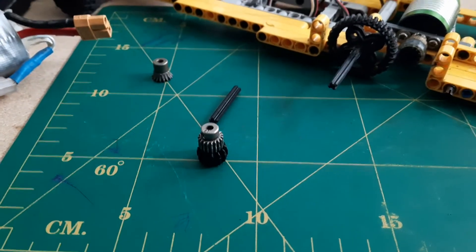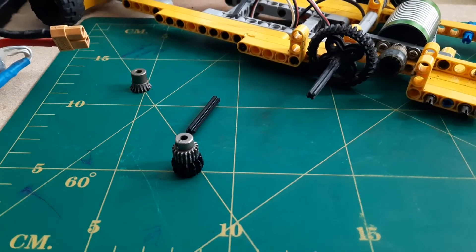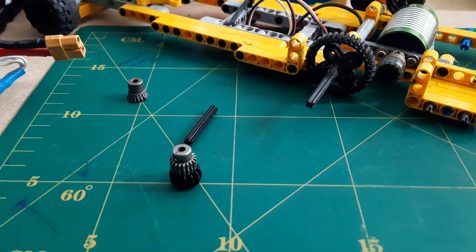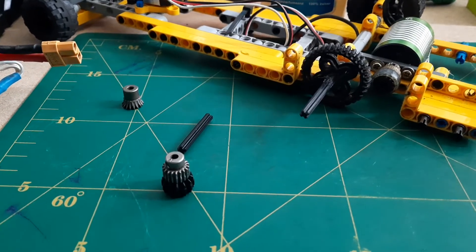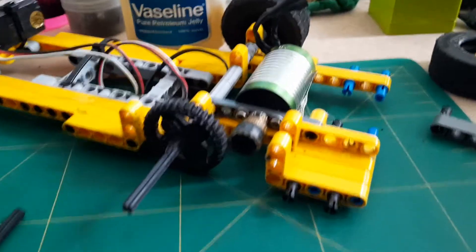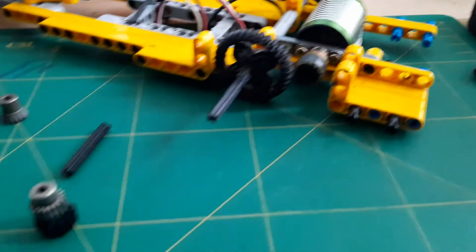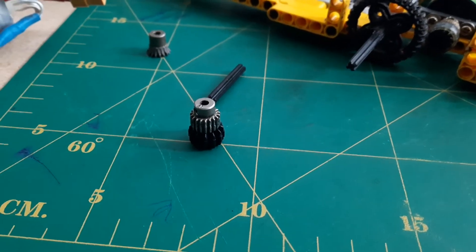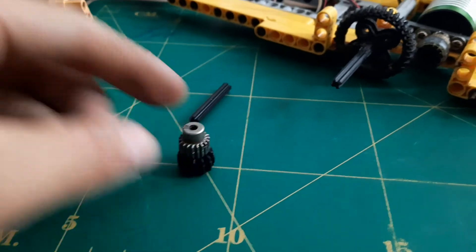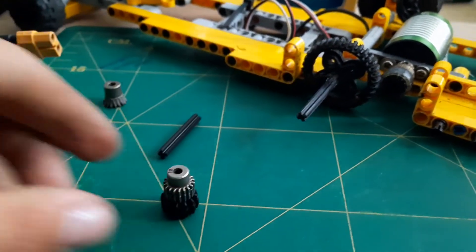I'm going to take what I found is the easiest way: use an old motor shaft with the diameter of your motor. If you have a 3.175mm shaft, I recommend you do it on there so it fits completely in line with the hole of your motor and it's not going to wobble.